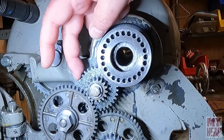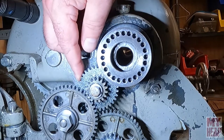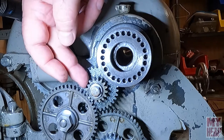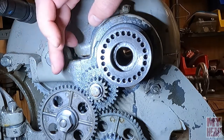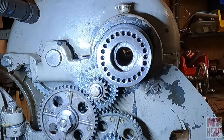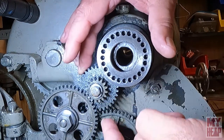Okay, so this is the 32-tooth compound with the 16-tooth gear — it's made into one piece and it is just an idler. Depending on whether the A position on the banjo is in the front, engaging with the 16-tooth gear, or in the back, engaging with the 32-tooth gear, it's just part of the reductions for whatever thread or feed you're using. If I were to pull this off — I can't because this is in the way — you'd see that this isn't splined; this is just free rolling.